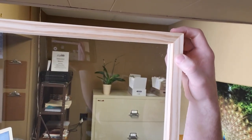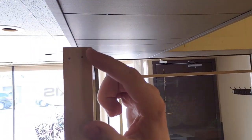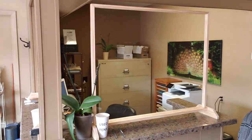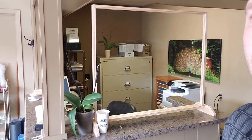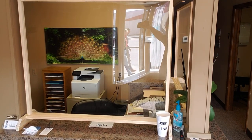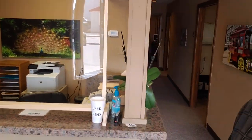Up in the corners I 45-degreed them — it's not perfectly perfect but it's pretty close. Then what we ended up doing to put it all together is you glue it and pin nail it. That gives you a pretty simple, inexpensive little shield. I know it doesn't go all the way up to the ceiling and it's not perfect, but it's a heck of a lot better than nothing. They're about 3 foot by 30 inches because that's the size the plexiglass came in. They're about $35 a piece. The first one took me about an hour just because I was figuring out how to make it, and the second one took me about 15 minutes. It took longer to put it together than to rip all the boards.